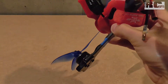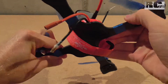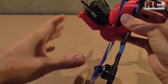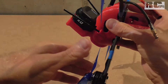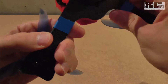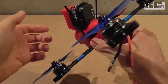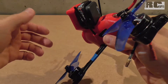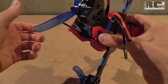But with this controller, after a few meters of diving, it began to drift — especially on the yaw axis but also on roll and pitch, it was pretty unstable. It didn't matter what I tried with PID settings or stock settings, the problem was always there. And the longer you dived, the more it drifted and went out of control. You had to correct the flight line with stick inputs, which is pretty tricky if you just want the drone to dive without any input.